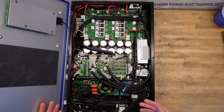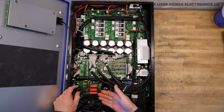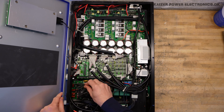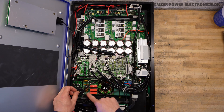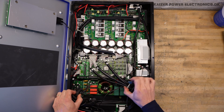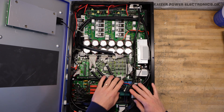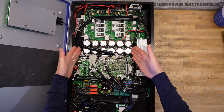A quick run through: we have our solar inputs down here with a lot of protection, because solar arrays are of course exposed to the elements, which includes lightning. So you have a lot of lightning arrestors and capacitors, MOVs, etc. sitting here on the input. There's also a decoupling over to the main filter, which has three large green capacitors. We have our common mode noise inductor here, three-phase. And it dives in under the control board — not hard to guess where our DC link is, and then we have our switches up here.